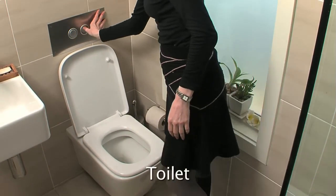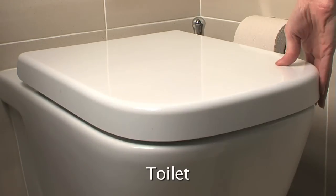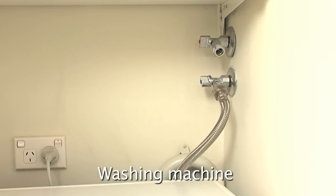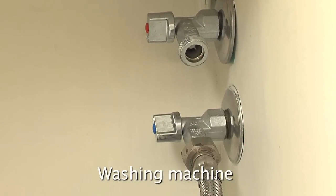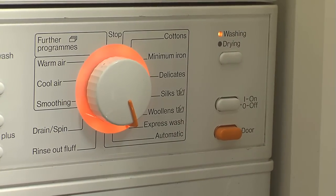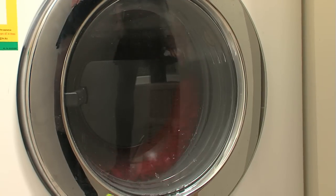Toilet flushing is a great use for rainwater — you only need a simple pump and there are few issues with water pressure or quality. Rainwater can also be connected to the cold inlet of washing machines. The rainwater must be free of sediment and discolouration. Washing machines need good consistent water pressure while cutting in and out many times each wash, so your pumping system will have to be up to the task.